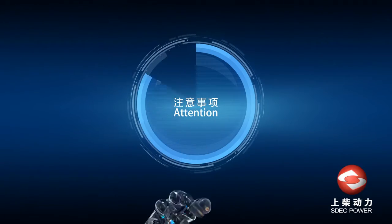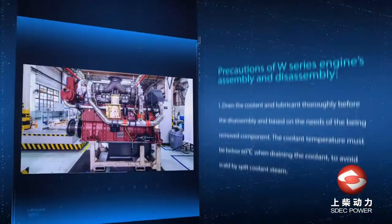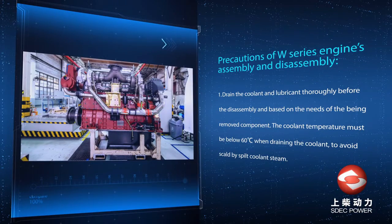SDEC W Series engine disassembly and assembly precautions. 1. Drain the coolant and lubricant thoroughly before disassembly, based on the needs of the components being removed. The coolant temperature must be below 60 degrees C during coolant draining to prevent scalding by spilt coolant steam.